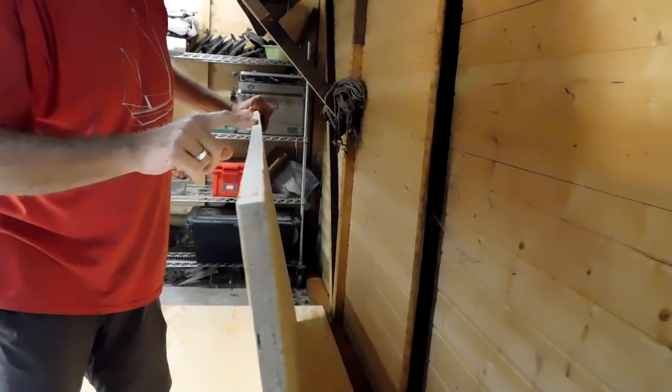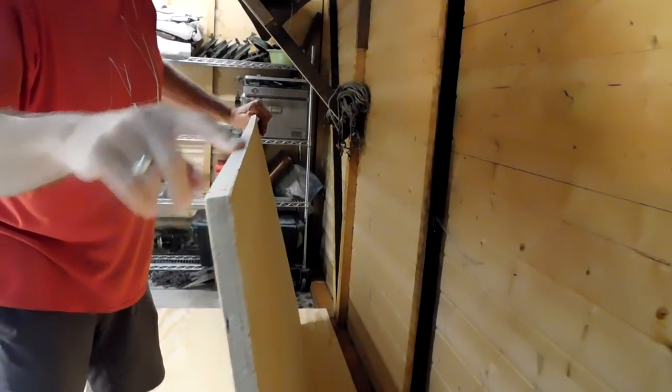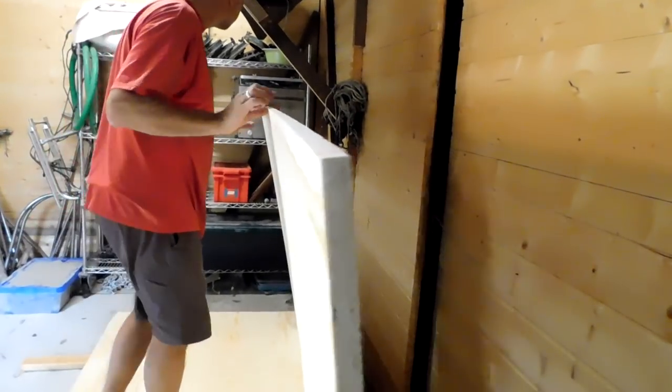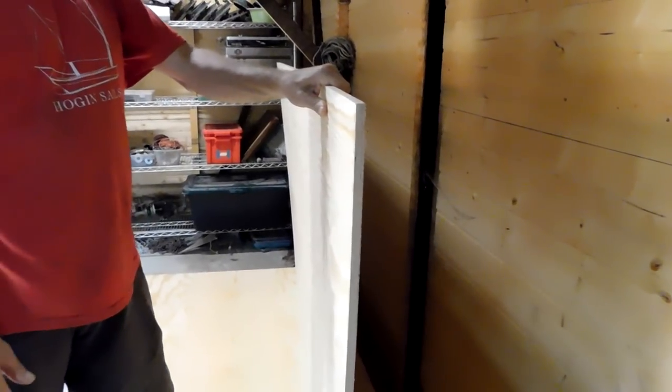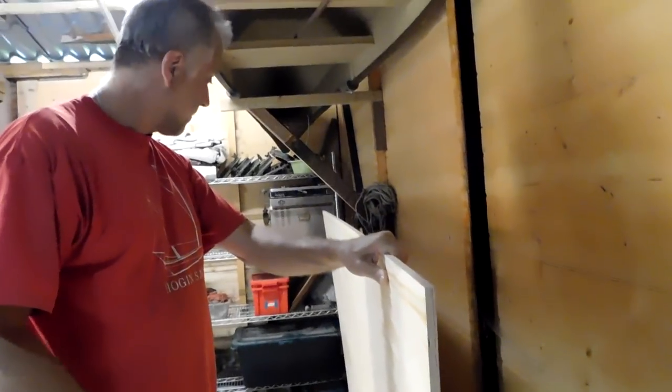And then coming onto the end of the plywood. Can you get onto the end of that? That's good. When we look at it here, 9 plies. When I look up the edge here, no voids to be seen whatsoever. It looks absolutely perfect. And some of the other stuff I've used, I did try Luan. Horrible, firstly tropical. Secondly, full of voids, almost useless, frankly. This looks like good stuff.